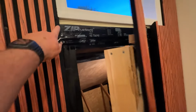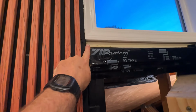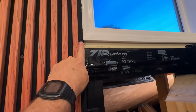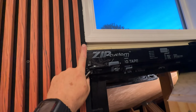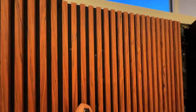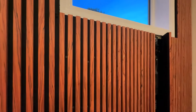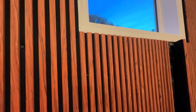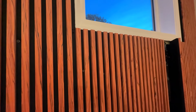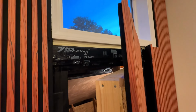I'm also going to put in here, there was a switch, but I had to take it out because it was actually keeping my kit from working because it was a normally open switch, and when you press it, it was doing the opposite of what I needed to do. I needed it to be a normally closed switch, so when you hit it, it opens, which is what happens when you normally have this thing working properly. It's closed. You want that sucker to be in a normally closed position. When you release the power, that's open, which is what this happens. I hope that makes sense.